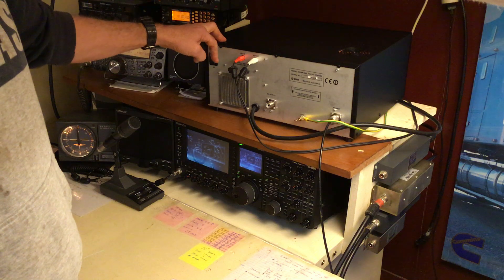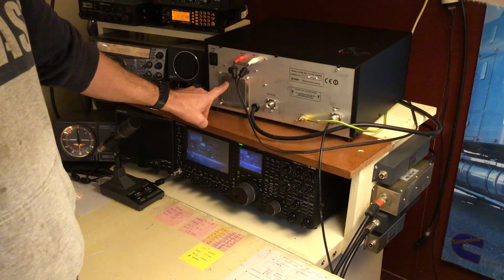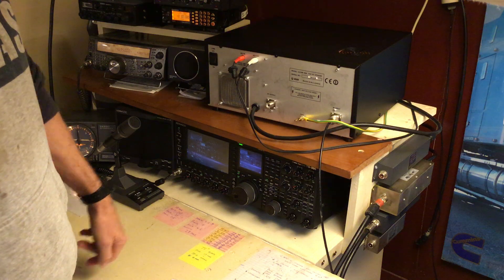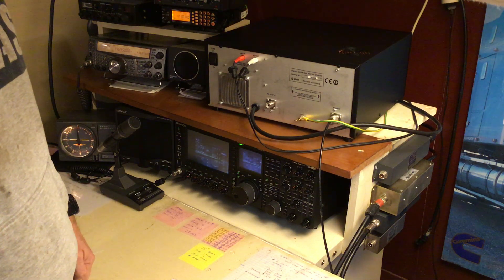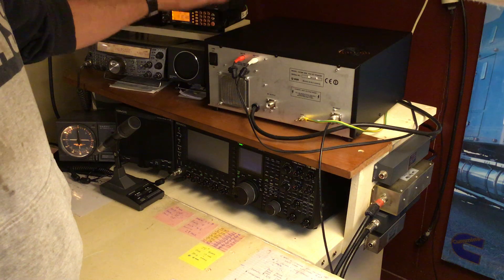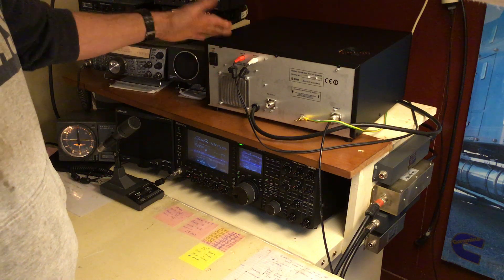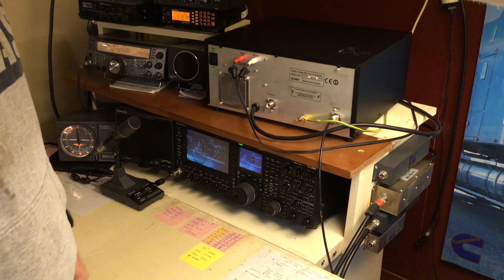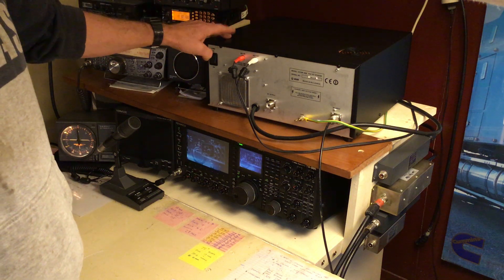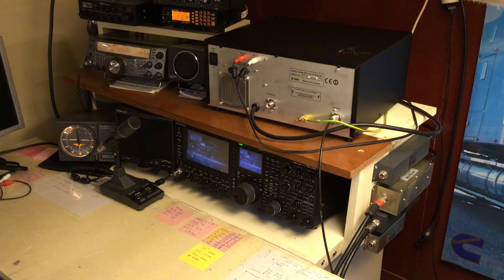Buyer beware — the only thing I'd say to keep an eye on with an Acom: when I got this it had a very noisy high voltage transformer, right about in there. It was very loud when I got it, so I sent it back to the dealer. They ran some tests and decided it was pretty noisy, so they swapped it out and sent it back. Now it's dead quiet — it's just awesome. You can have the thing running, transmitting away, right in front of you, no headphones needed. So buyer beware: keep an eye on the high voltage transformer. Some of them seem to be quite loud. But outside of that, they're pretty much bulletproof and a pretty good bang for the buck.